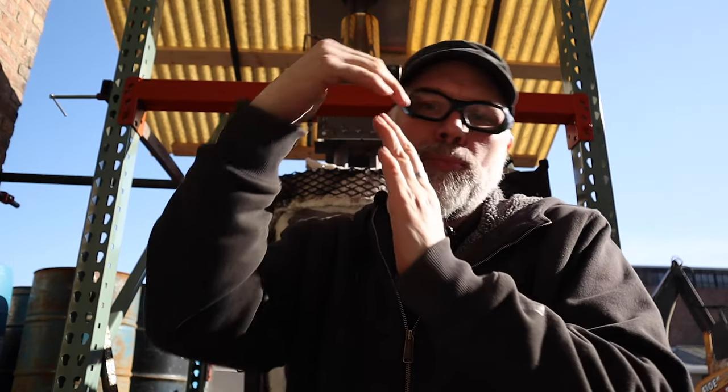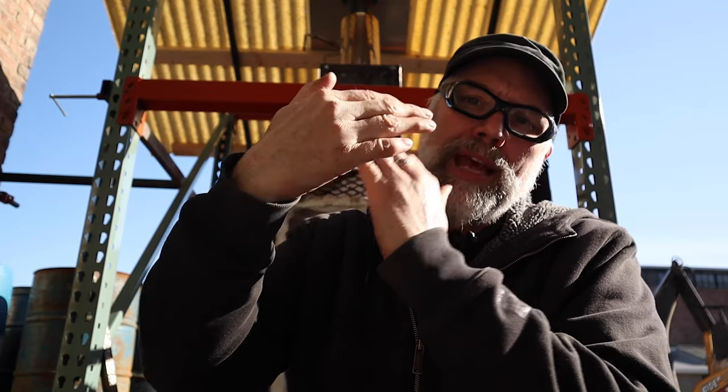If you're in a soft brick kiln, much less a hard brick kiln, you really need to preheat your kiln up to that dull orangey color, or actually a bright orangey color, like I said, about 1400 degrees or so. The reason for this is as we put the mold into that chamber, we want the heat to equally saturate all surfaces of our shell. That's going to instantly liquefy all the wax contacting the surface of that interior shell. Then as the wax starts expanding, it creates a hydraulic nature to it. As it expands, it pushes that liquid barrier that's already between the wax and the shell, and flushes it out of the mold to help push the wax out.